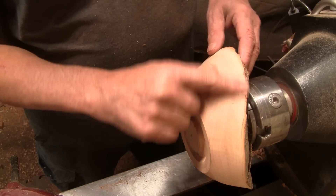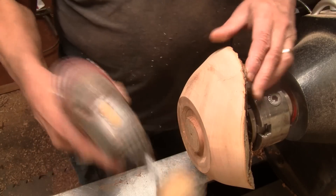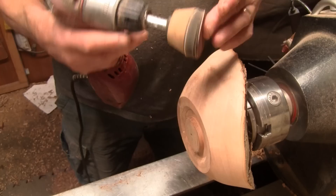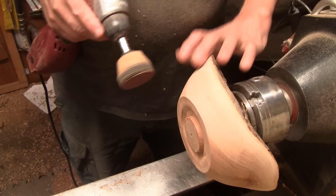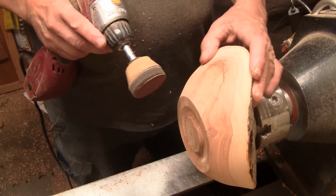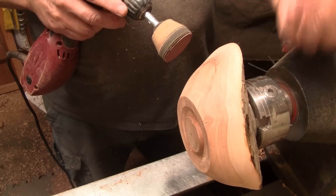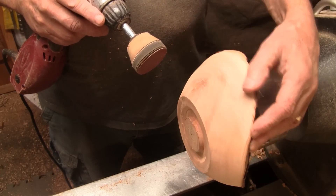I think I'll get ready to do some sanding. I found a couple more places to put some CA in there, so now I'm going to go ahead and sand. I'll start with 80 grit on a two-inch disk, just holding the piece and sanding these areas by hand, spinning it in reverse at about 400. We'll get it sanded up to 400, and I'll have it flipped around and put the finish on this side later after I figure out what I want to use.